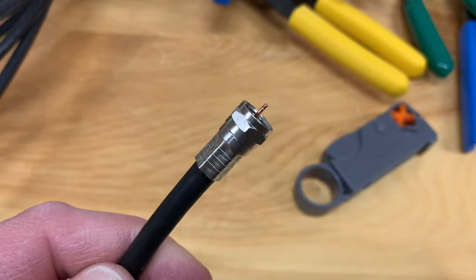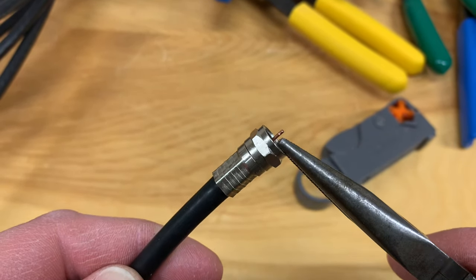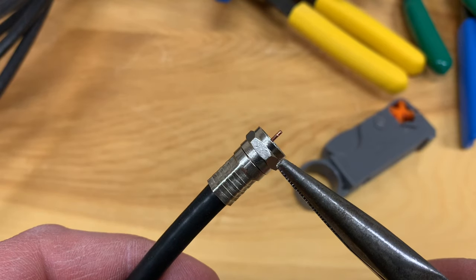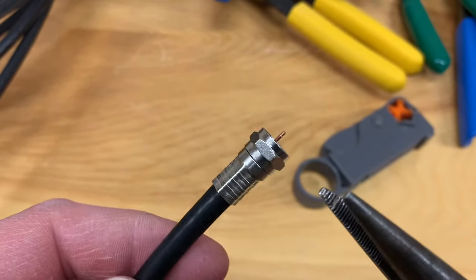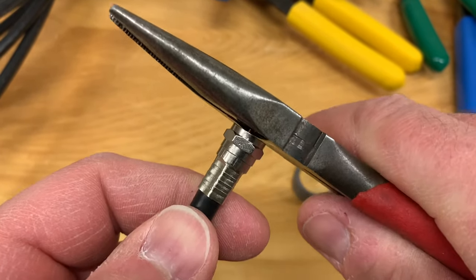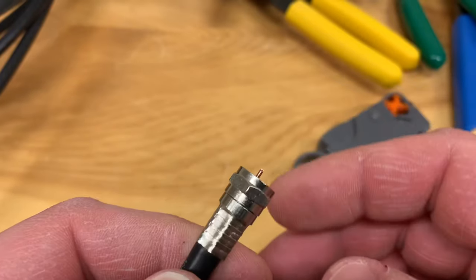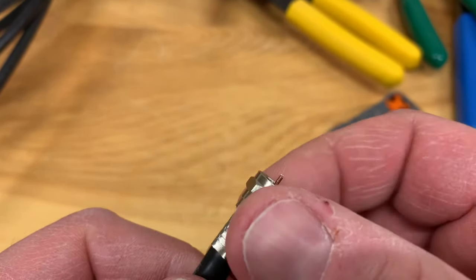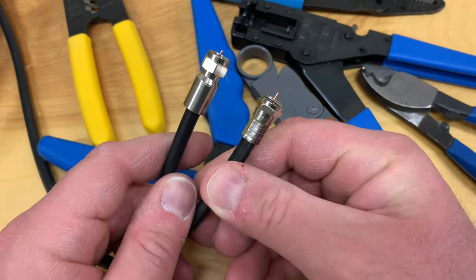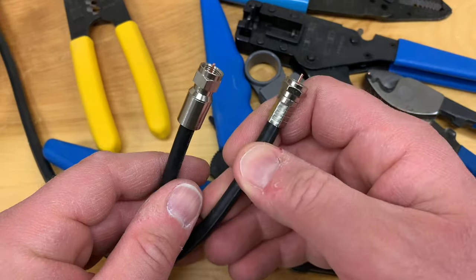One fiddly detail that everyone seems to have their own opinion about is how long you're supposed to leave the center conductor sticking out of the connector. You definitely don't want it sitting below the rim — if it's too short, you're not going to get a good secure contact when you connect this to your TV or receiver. A trick I like to do is just put the needle nose pliers on the conductor and rest it on top of the connector and cut it like that. Then you still have a little bit of length sticking out, which is a good length and certainly not too long to interfere with proper installation. So that was a video on preparing your own coaxial cable. This is a crimp connector, this is a compression connector, and it's kind of satisfying to make your own cables up. Thanks for watching.